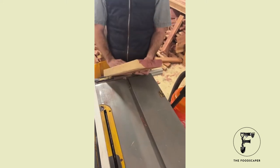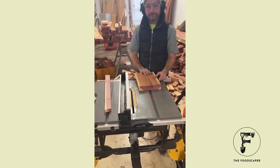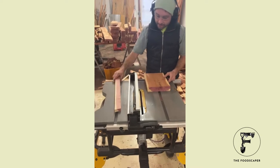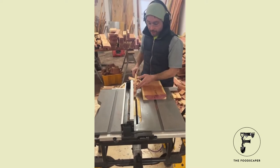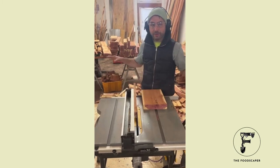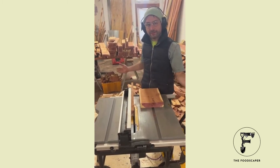We've got the bevels that we needed on this block, and now we'll use the table saw. What do we need to know about this step? Mainly, just keeping this distance consistent throughout the batch is going to be really important, because that actually determines the length of some of our longer pieces.